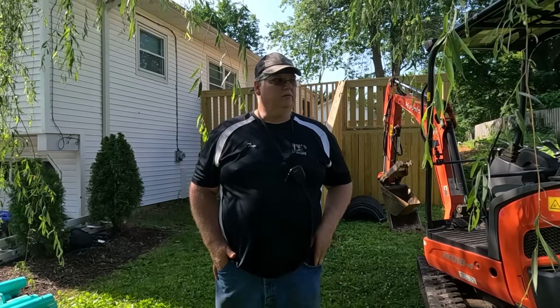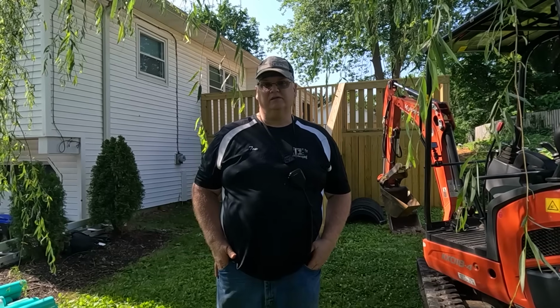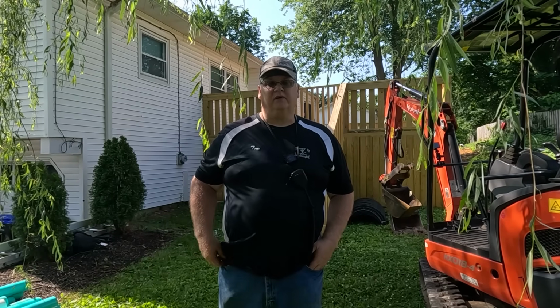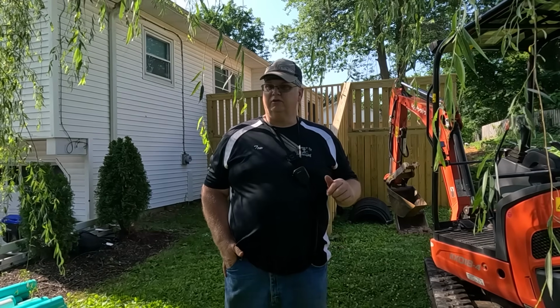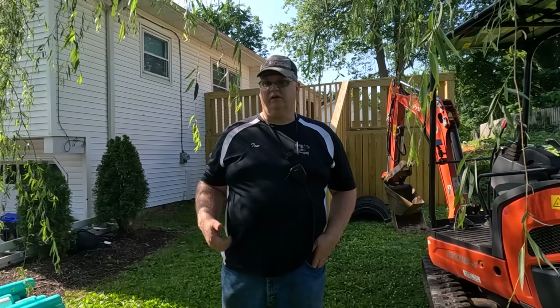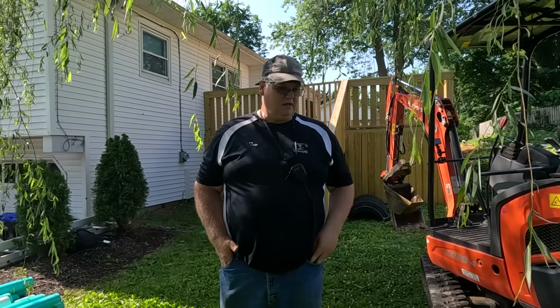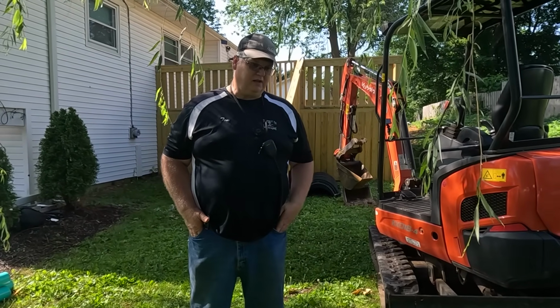The first reason he needs this dry well is they're getting water in the basement on this side of the house. So we measured the roof, and we calculated that in a 1-inch rainstorm they get 500 gallons of water coming off this roof going into 2 downspouts. And so we're putting in a 500-gallon dry well to take that in, and then it will have an overflow that runs 10 feet from the curb.